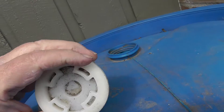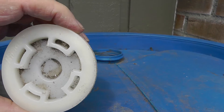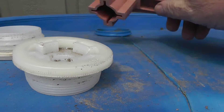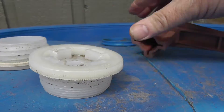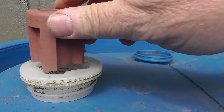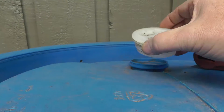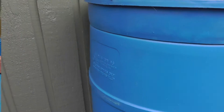These are the plugs that came off the tank. This one has regular two-inch IPS threads with an inset for the bung wrench, which fits right in to tighten and loosen it. This other one has a coarse thread — I believe they call it a buttress thread — and it also has an inset for the wrench, as well as a three-quarter inch tap if you want to run three-quarter inch pipe into it.